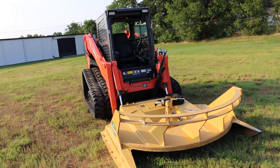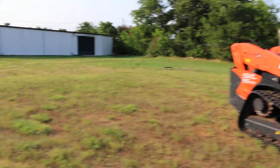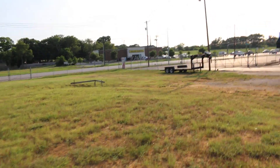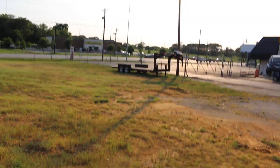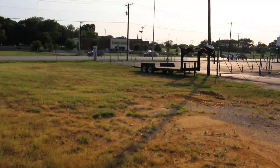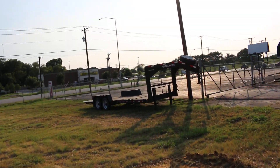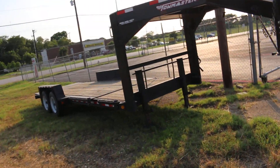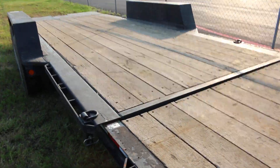There's also a trailer that's available. In fact, let's walk over here and look at the trailer. It's a tilt trailer with 215/17.5 rubber on the ground — pretty heavy-duty axles. It's made to carry the tractor and the mower. It's a Tow Master, very low profile. You can pull it behind a three-quarter or one-ton truck. It's got a wood deck and this portion tilts back.